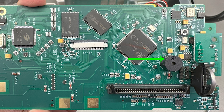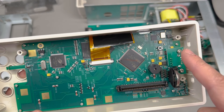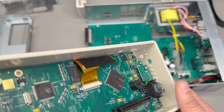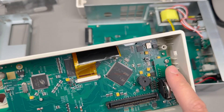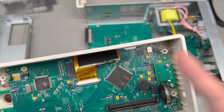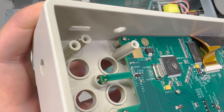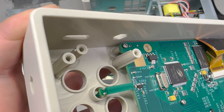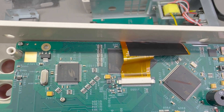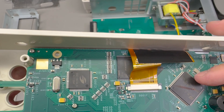Here is the buzzer, which I think is dead on my unit. It's interesting how the USB connector sits on its own separate smaller PCB - that's probably because they didn't want to offset the entire front panel board with the height of that USB Type-A connector. We probably have other support chips in here like an Ethernet PHY. On the input terminal side we see a thermistor, which is for sure in charge of the cold junction compensation. There's also what looks like an LCD driver IC and some external memory right behind the flex going to the LCD.